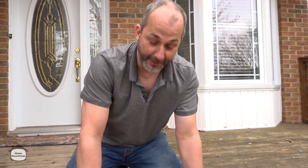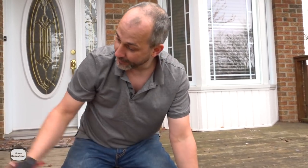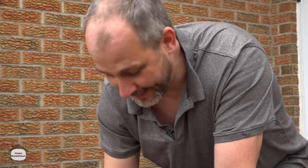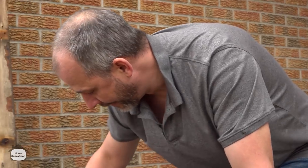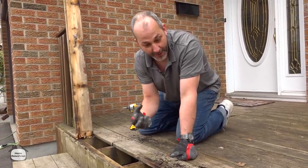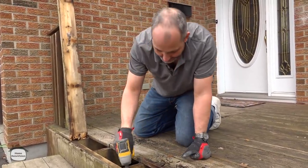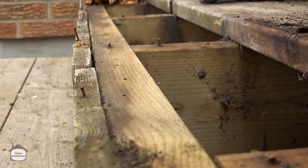This is a great reminder that it's not. If you don't install it properly and you don't treat your deck, the screws will rust out and rot and they'll just be useless. When I lifted this up, I was expecting to see a lot more rot on the surface. This is a testimony to how good quality a pressure-treated substructure is. This was built wrong, it was holding moisture, it wasn't able to dry — and it still isn't rotted out the top of the wood. It can still hold a screw. That's amazing.